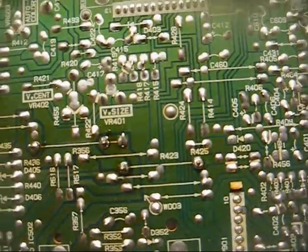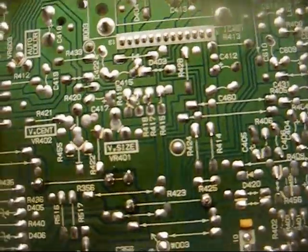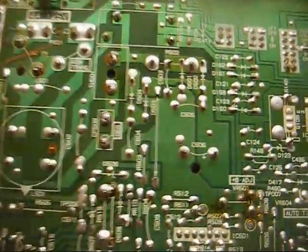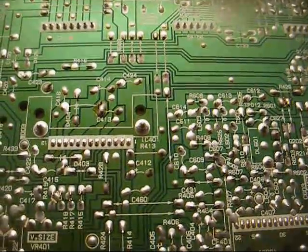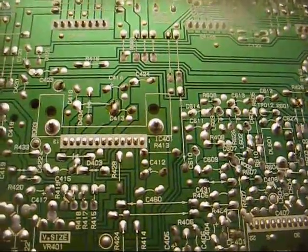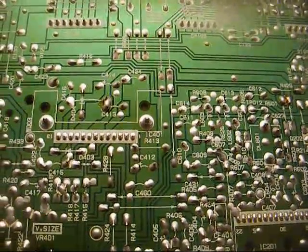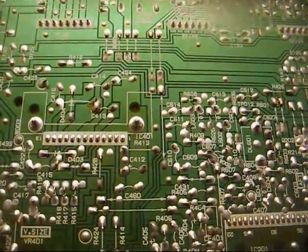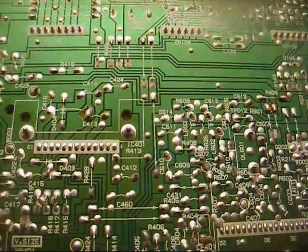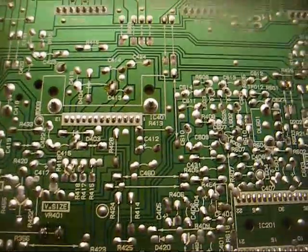You know, they were kind of blackened around the circuit board, so I went ahead and resoldered them so there wouldn't be any trouble, and resoldered a few things up here, the degaussing thermistor, etc. These boards were obviously not soldered by hand. They were soldered by a machine, and often not soldered that great from the factory, and after 30 years of heating and cooling, some of the connections can break loose, especially on high temperature parts such as resistors and heat sink mounted transistors and ICs, etc.